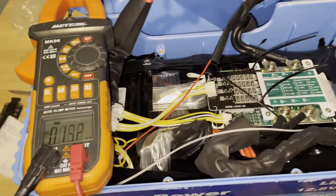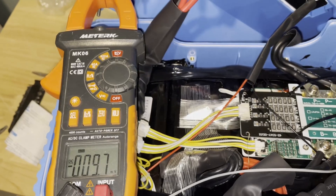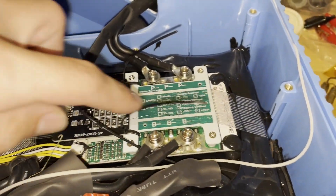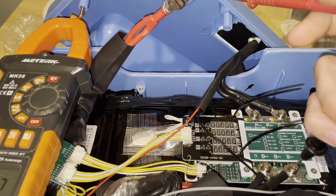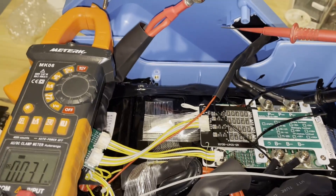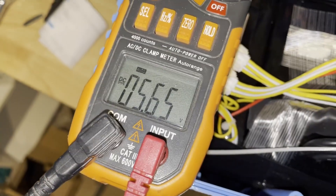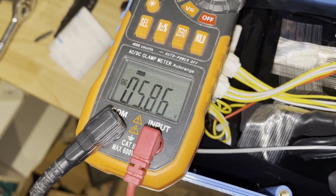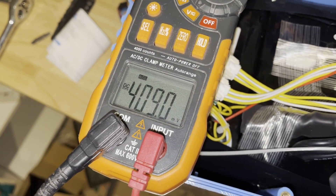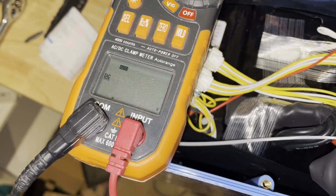So we're back at my house now. I did go ahead and replace the batteries in that system and as you saw, it was working again. This is the one that is suspect. When we hit the button, nothing happens on this display. You'll notice that the wires for this meter go straight to the battery — it doesn't go through the BMS. If we measure between positive here — this is actual voltage of the battery — 5.8 volts. That's no good. And then if we measure on the far side of the BMS: 5.66 volts, a little bit lower. So it's possible the BMS is shut off, but not by much — just a little bit of resistance in there.